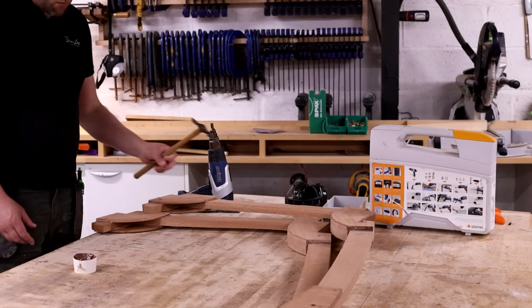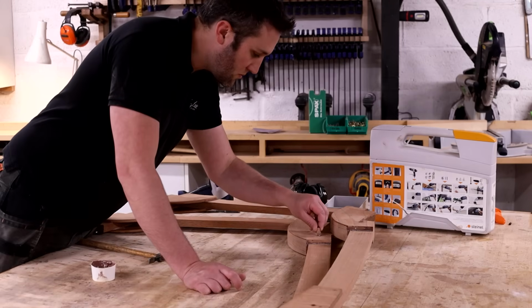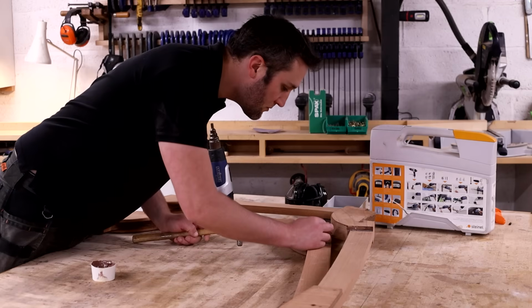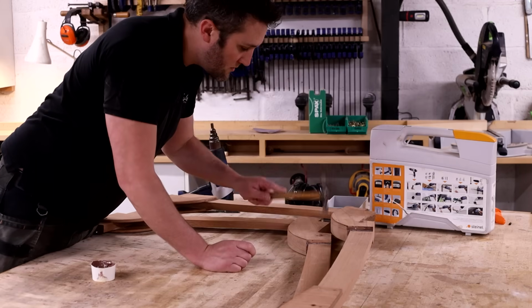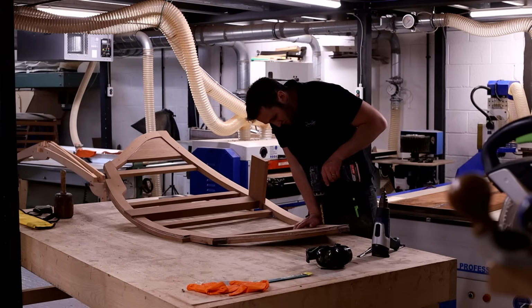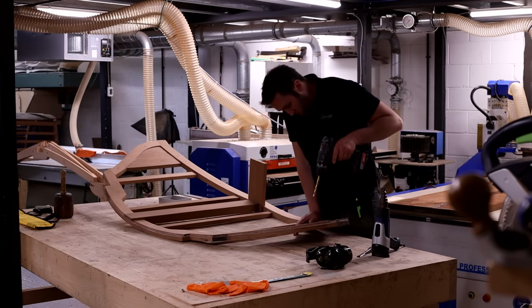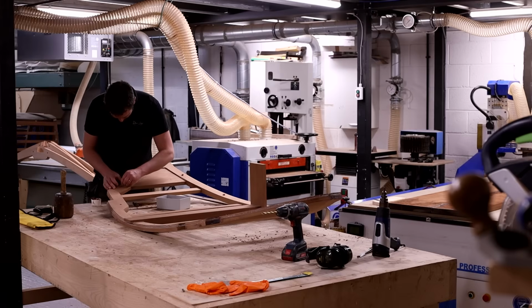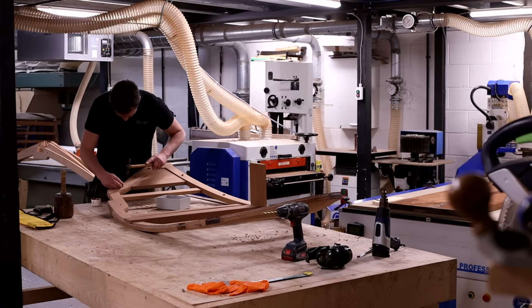We get those holes plugged that we've used to build the frames and also to locate them on the machine for pre-beveling. So we go in there with some long tapered utility plugs. And the same can happen from the transom, so that's ready to go in very shortly. So I'll plug all of the holes that I used there to fix that down to the curved building jig.